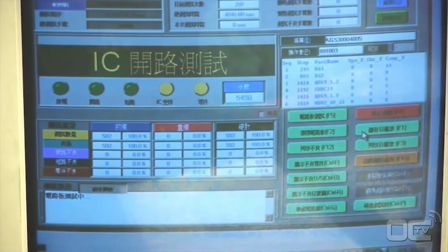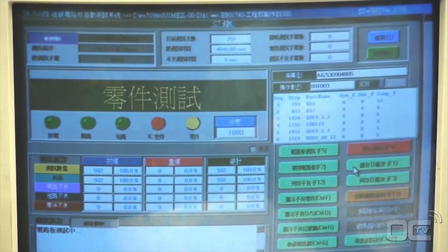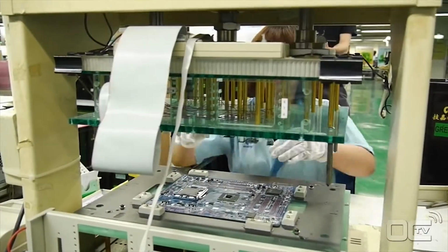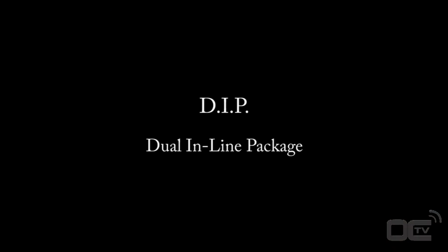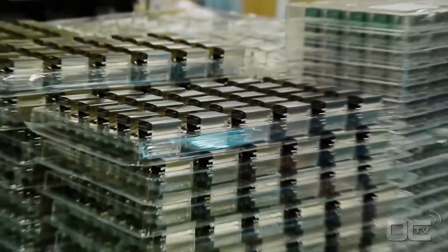This factory floor is dedicated to additional verification, especially for server components. Some boards are tested by X-ray to verify the quality of soldering. This inspection is a high-quality service that allows very high-end and server motherboards to be checked in more depth. Once these last tests are made after the SMT, it's time to go to the DIP, or Dual Inline Package.